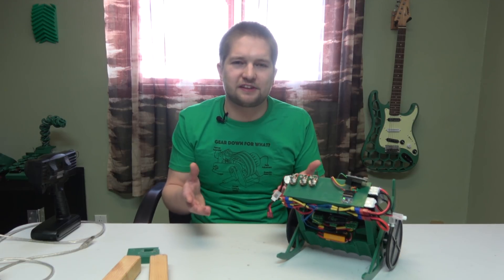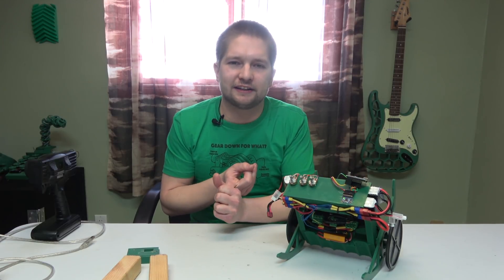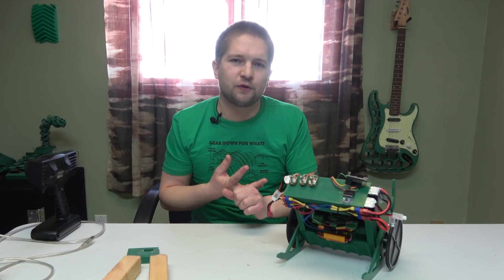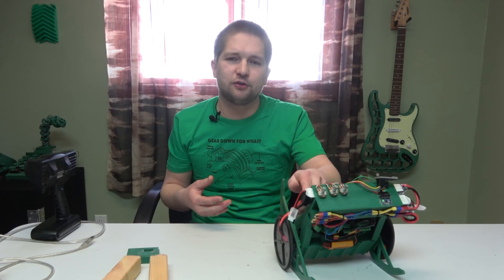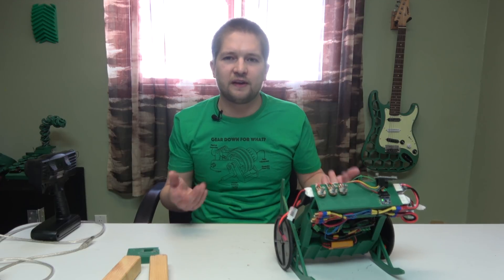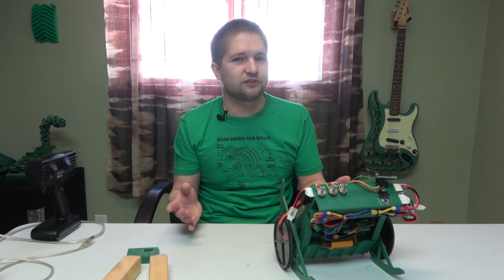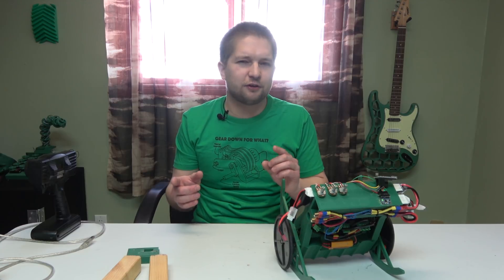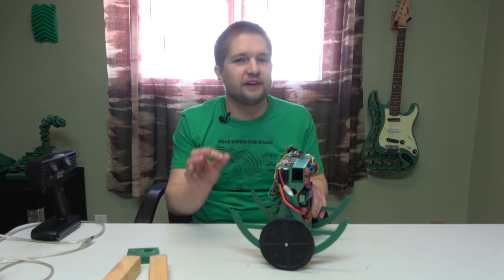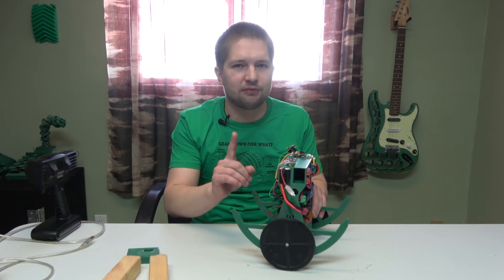The DMP sketch also wasn't happy any time I did things like writing a servo output or reading a servo input, meaning I couldn't use the RC receiver or write values to the ODrive from the same Arduino board anyway. So whatever the reason, using the separate Nano solved it. Now we're at a point where this thing does balance, but there is one problem left.